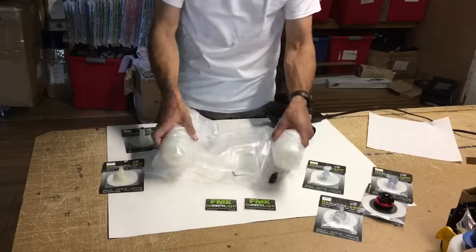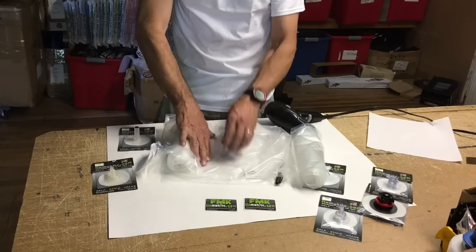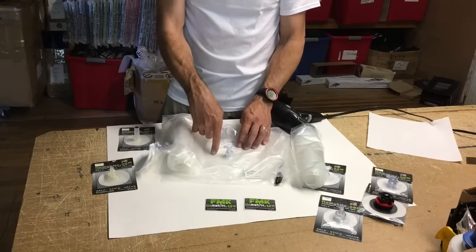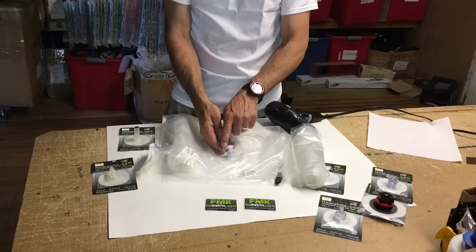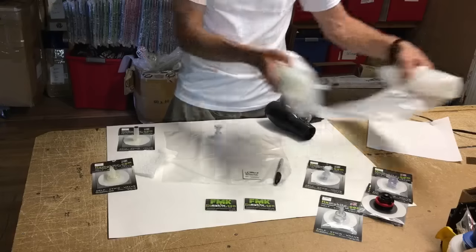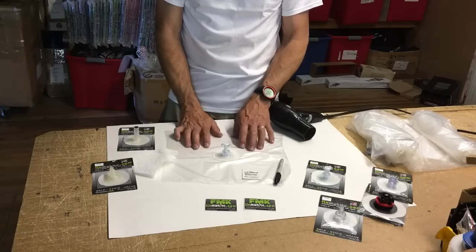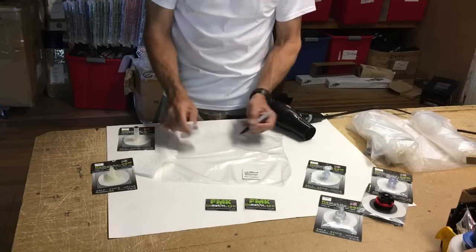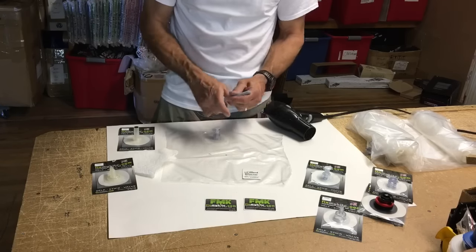Here's a bladder and you can see how the valve is put on. If I was going to replace this one, what I do is mark the side of the little bump — which is basically the hinge of the valve — and the direction it's going to be facing. So I would mark the side and then I want my valve in that location.